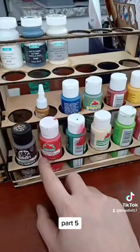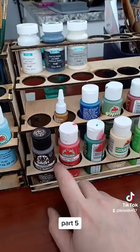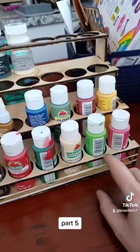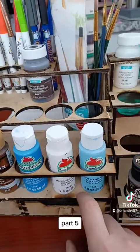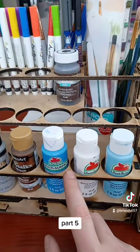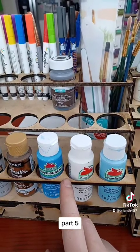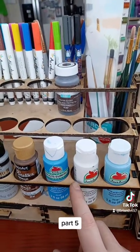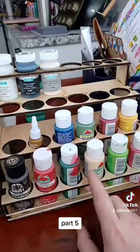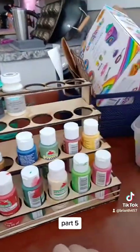And this sheet of plywood cost me $14 for a 2x4 sheet. I cut both this morning, and this cuts so much better. The cheap one took something like four passes to get through; this took two. The reason is that cheap plywood uses a lot of filler, and the filler cuts at different rates than the actual wood, so you end up doing extra passes. With higher quality wood it's more consistent, less filler — you can just wham, bam, thank you ma'am, cut it out.